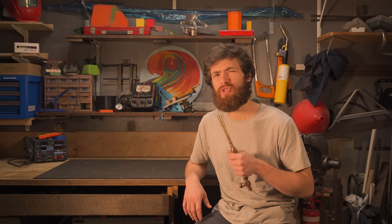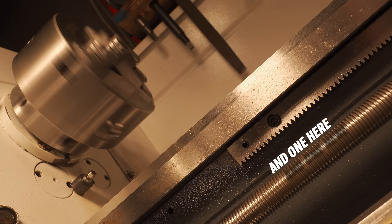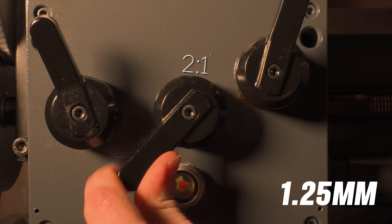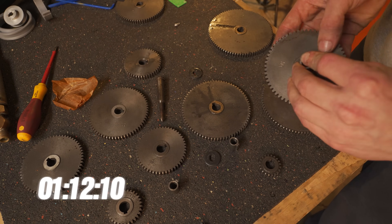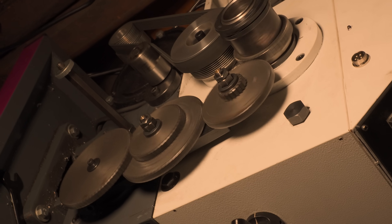If we want to cut a thread with an extraordinarily convenient pitch of 2.5mm, we just have to have the lead screw rotate once for every rotation of the spindle. We could also cut a 1.25mm thread with a ratio of 2 to 1, or a 5mm thread with a ratio of 1 to 2. And on my lathe, with its 3-speed gearbox, I can quickly switch between these pitches. But there's one crucial detail: its 3-speed gearbox means there's no overlap between threading and feed pitches. Any time I want to switch from turning and facing to threading, or vice versa, I get to spend a couple of minutes reordering the change gears. If you consider that 50% of the parts I turn want threads, and 100% of the parts I need turning, I'm wasting about 150% of my life on the process. So the plan was simple: get these gears off, and attack the problem from 3 sides.